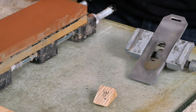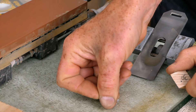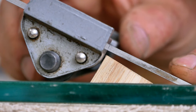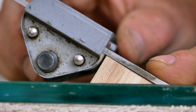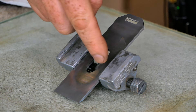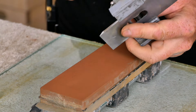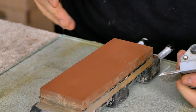If you're rebeveling a damaged chisel or plane iron, you're going to want to regrind it to 25 degrees. But if you're just honing the edge like we're doing today, we're going to be using the 30-degree angle instead. The main grind on the back side is 25 degrees, but the hone angle is 30 degrees. The way I'm going to set this up is I'm going to grab a little chunk of double-sided tape, stick it down, and then stick this block on top of it. Then I'll set the honing guide and the blade over top of the block, put a couple of fingers right here, and carefully roll the wheel forward while pushing the blade back until the angle of the blade matches the angle of the block. Double-check that this is referenced in there nice and square, and then go ahead and tighten up the screw.